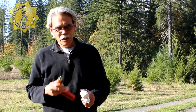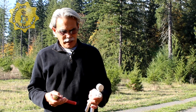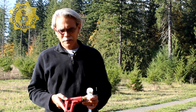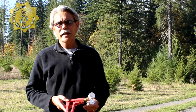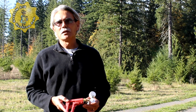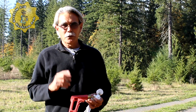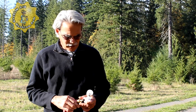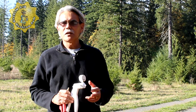Here are a couple of examples. This pump came from China and has no gauge, so you really don't have any way to monitor how much vacuum is being applied. So the first rule of thumb: your pump should have a gauge.